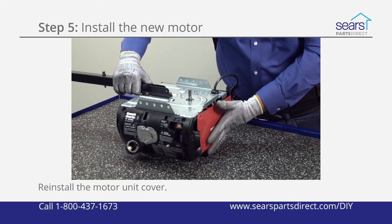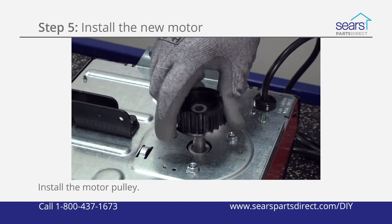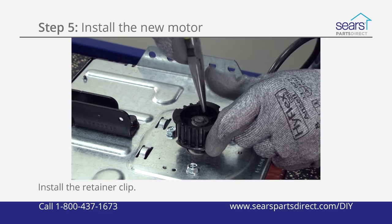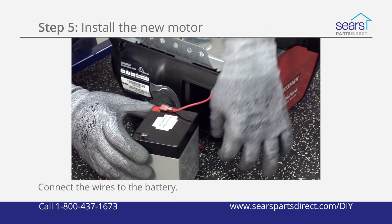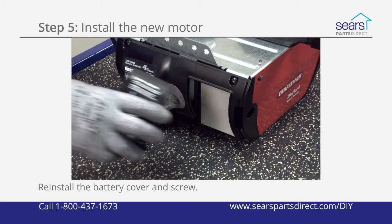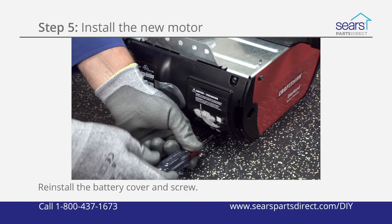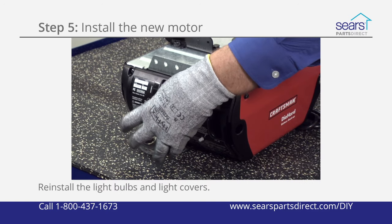Reinstall the motor unit cover, securing it with the mounting screws. Install the motor pulley and secure it with the retainer clip. Connect the wires to the battery and insert the battery into the battery box. Reinstall the battery cover and secure it with the mounting screw. Reinstall the light bulbs and light covers.